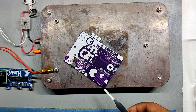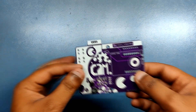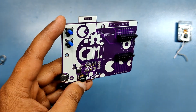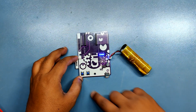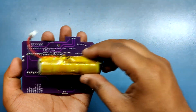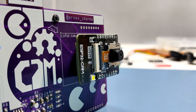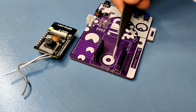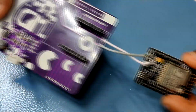We lift the PCB and place it on a cool surface to let it cool down. After completing the SMT process we add the remaining through-hole components like the USB port, header pins, and battery connector. After adding the lithium cell and checking the output voltage at 5V and ground, I added the ESP32 board onto the PCB. Before that, I added wires to the terminals of the SMT reset button on the ESP32 and connected those wires to the connecting pads on the circuit — essentially adding this external switch in parallel with the SMT button of the ESP32.